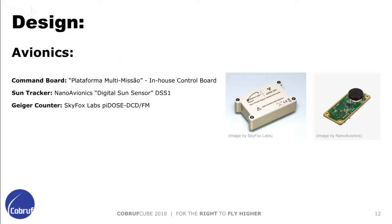An algorithmically based decision making from voting. So if you have multiple processing units and most of them agree onto something, and one of them is damaged, then you can use voting-based decision-making to exclude any faulty parts from taking bad decisions.